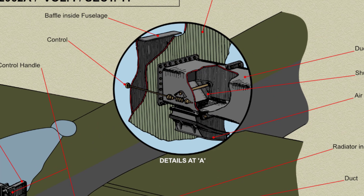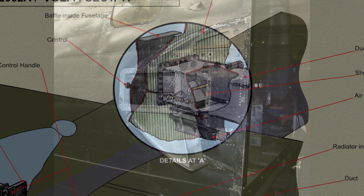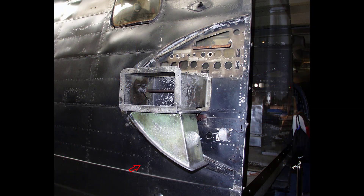The control valve box, which is a light alloy casting bolted to the fuselage side, has two outlets: one at the inboard end to supply hot air through an opening in the fuselage skin, and the other at the bottom connected to the bypass duct, by which the hot air can be discharged through a louvre below the mainplane leading edge.